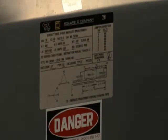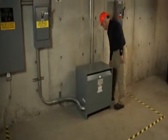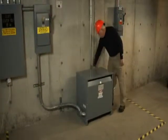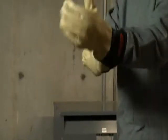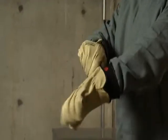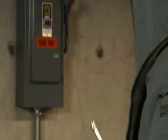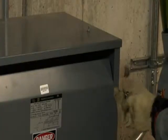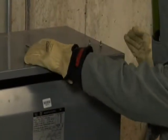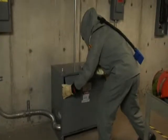All of this data will be used later. If you suspect your transformer is overheating, your next step can be to use your hand to feel the area around the transformer for any signs of excessive heat. It's important to use the proper personal protective equipment, or PPE, when inspecting and testing a transformer. Set up your boundaries and select the appropriate PPE for that category. Listen for any abnormally loud humming or buzzing noises, and be alert for the smell of overheating insulation. You should scan the transformer with either a thermal imager or an infrared thermometer.